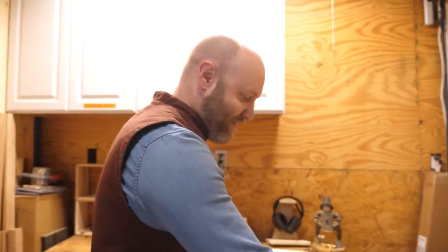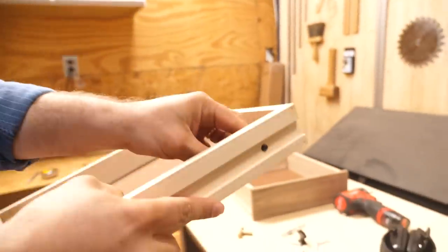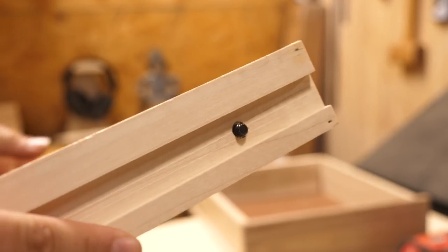This is a fun distraction. Dieter Rams. Bennett came up with such a good idea. The problem with wood sliders is they work really good, but you can rip the drawer right out. So Bennett, clever son of a bitch, in the drawer runners there's like a slot. And then on the side of these drawers, there are just little threaded inserts with screws. Screw it in, and that is captured in that slot, so you can't pull it out. It's a stop. You can't pull the drawer out. That's pretty cool. I think it's clever.